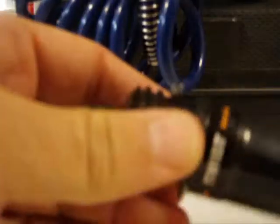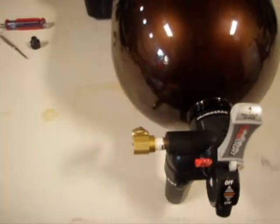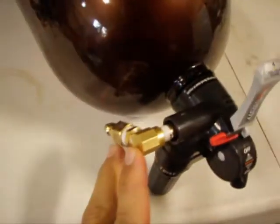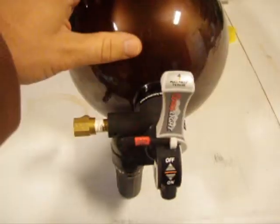To make sure we don't have to worry about the fins, take a look at the side where the fins sit — you can by hand, or with a pair of pliers or needle nose, just work them off. This is the completed system: a modified homebrew tank with a little plumbing hardware to fit a standard quick connect regulator. I made a small adjustment by rotating the entire thread to a slightly backward angle so we'll still be able to utilize the base system that came with the keg.